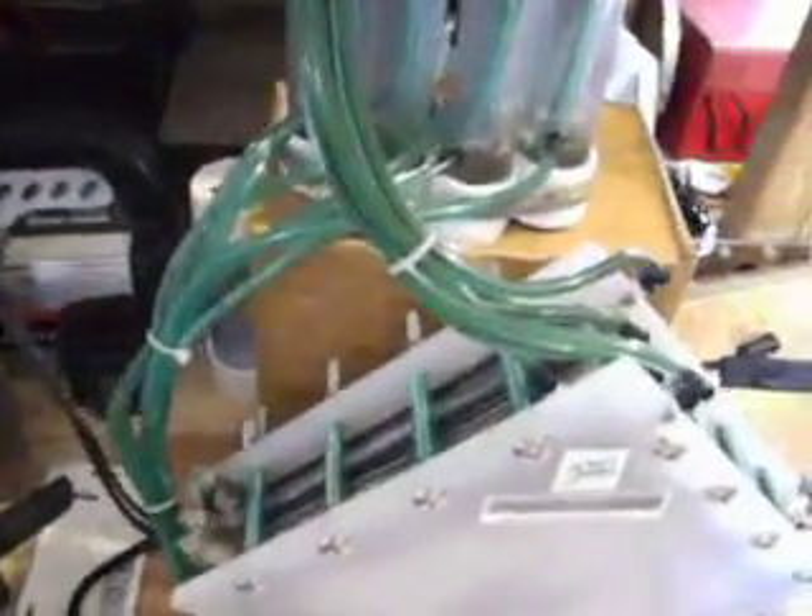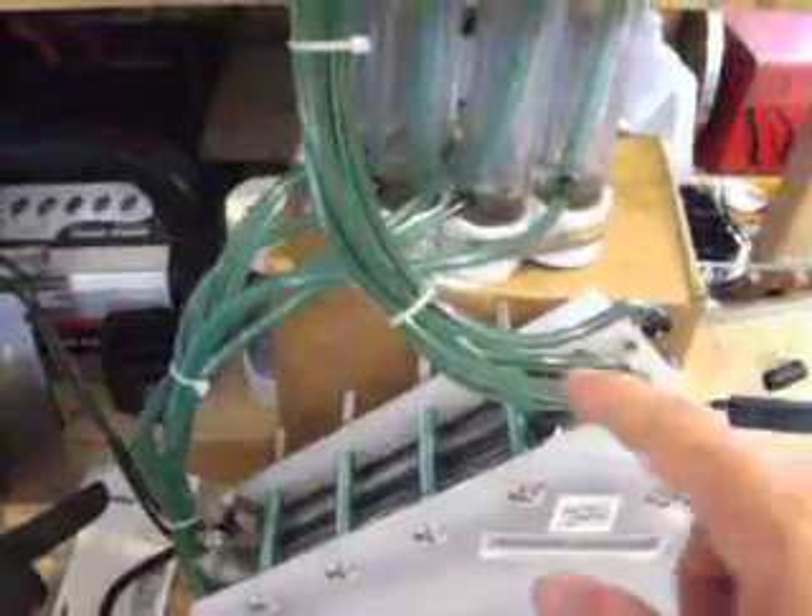You can see this is drilled down to this point, and at the end of this point right here corresponds with the hole in the plates. Same exact thing on the bottom as on the top. So what I've created here is a circulatory circuit that does not require a pump. The gas that's produced in the cell comes up through each individual line, and each individual line goes to its own separate bubbler. You can see it's kind of bubbling away very slowly right now.